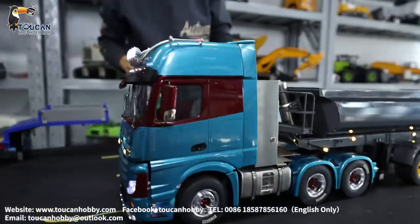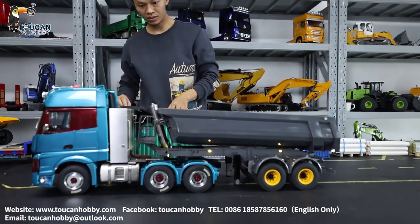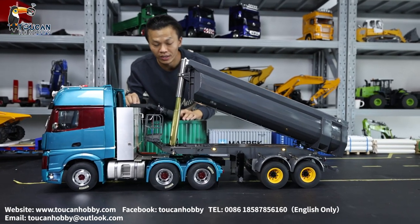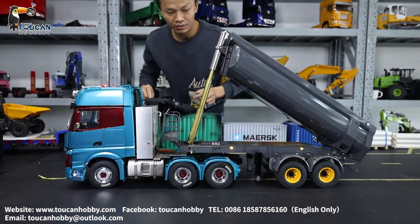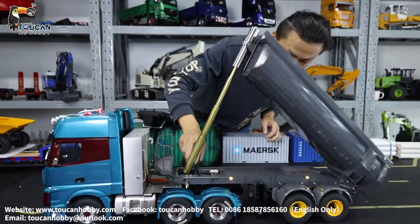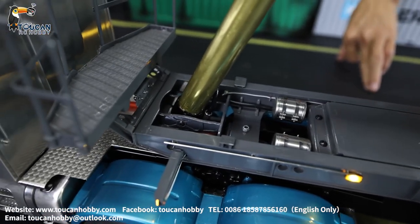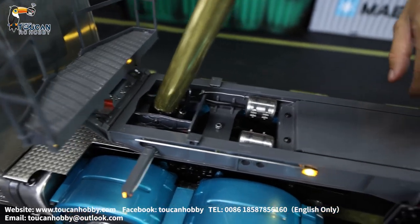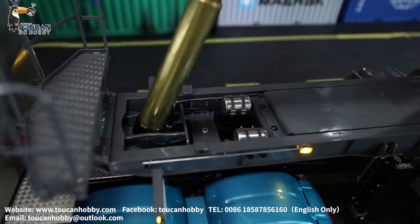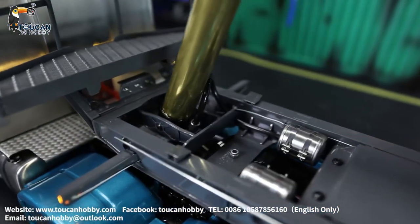Time for unloading — let's lift up the damper and dump the bucket. This one is a single cylinder, so only one line in. It reaches the top, so it stops. From here we see only one hose going inside. There is no distribution valve — only the motor turning different ways. One direction pushes oil inside to lift up; the other direction suctions the oil out. Let's bring the bucket down.